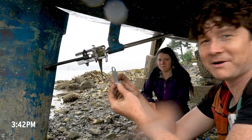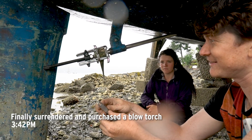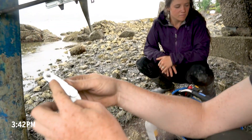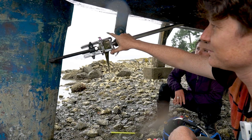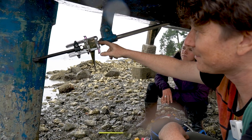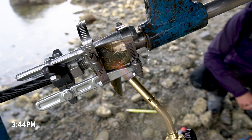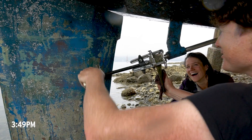The weak spot in the gear puller is the linchpin bar — it stretched and elongated the hole, so we improvised by bolting it directly to the arms with hose clamps to keep it from popping off. We're going to put a blowtorch on the bronze propeller to expand it without heating the shaft. And that worked — it came off easily.